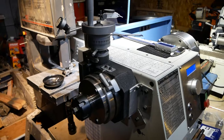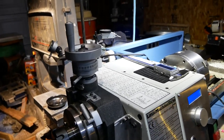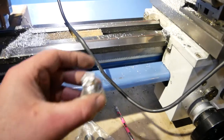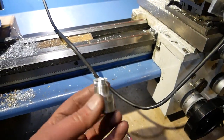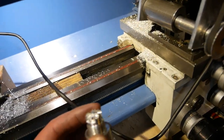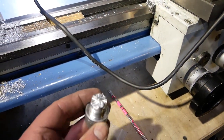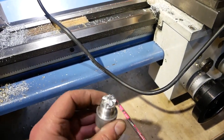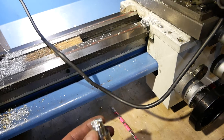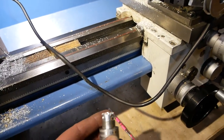It's been on the lathe for about a month, mostly sitting unused until I finished building the grinder earlier today. This is the first thing I've made with it — this was the fixture for making that nut, just messing around with a 4mm and 2mm mill. This is what I made with it. It turned out pretty cool — there's a U-type feature that goes around other features every 60 degrees with a gap in between. That wouldn't have happened without the rotary table, and it certainly wouldn't have happened without the grinder either. I needed both.